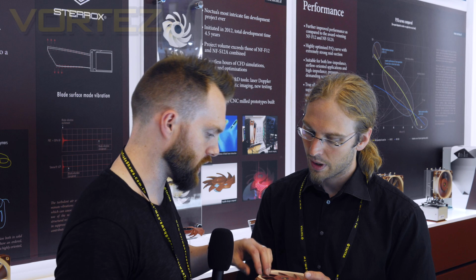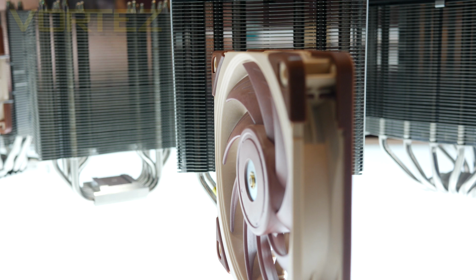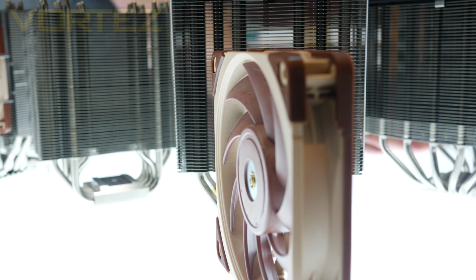Okay. And anything else you can tell us about why it's taken so many years to engineer and research the materials behind it? Yeah, the obvious downside of choosing a smaller and smaller gap size is that the tolerances get smaller and smaller. And most importantly, we're facing a problem that's called impeller creep. If you have a fan running for many years, due to the centrifugal forces, the impeller will grow slightly bigger. How many years are we talking, or months? We're talking about something like 5 or 6 years of usage.